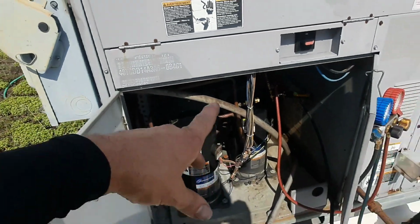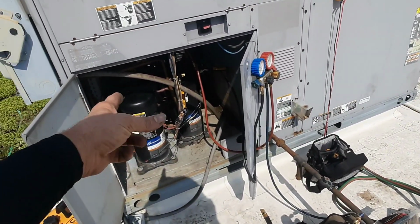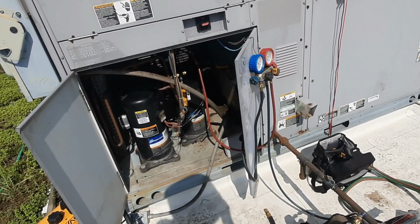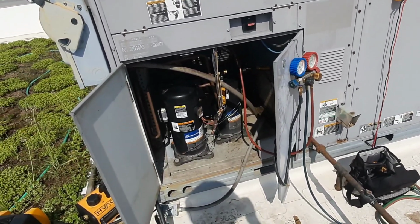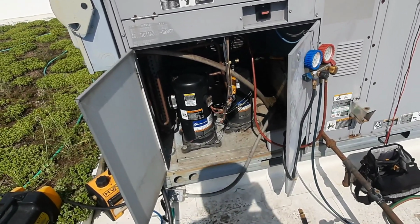Everything normalized. The question is, what plugged the dryer? Because that orifice, I blew it out, but I didn't try real hard to blow it out. It's just like there wasn't a restriction there at all, and I didn't see the restriction prior, so it's a little weird. Let me know what y'all think about it.